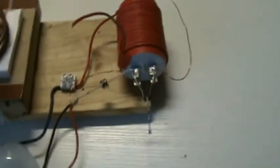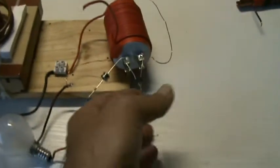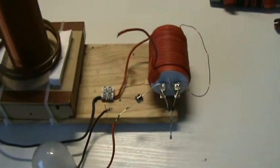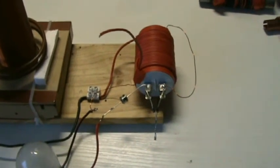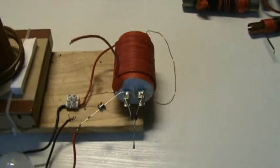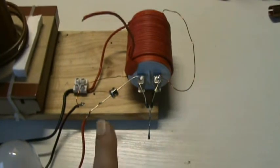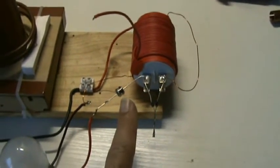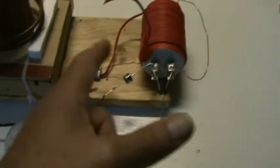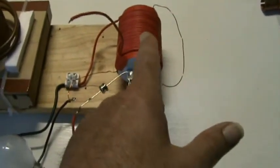My hookup at the moment, what did I have? I have a lamp, like yesterday, in series with this Capcoil. But the Capcoil I have now is a 30 microfarad motor start run capacitor. I have the AV plug, two 1N4007s, and I have this 250 volts AC, 360 volts DC lightning arrestor in series with the bulb, 25 watt, and then back to a coil from magnet wire which is underneath this one.